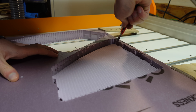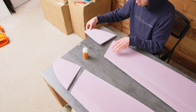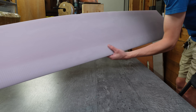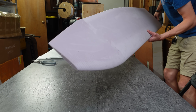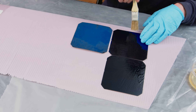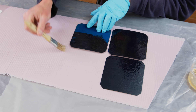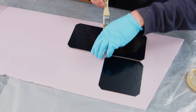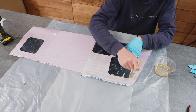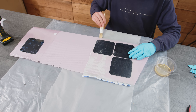That was just the main sections — I also machined some wing tips that got added onto the ends. So that leaves us with two really nice wing halves, but they're super delicate. The trailing edges are paper thin and can get damaged really easily, so I needed to cover the wings in something, and I also needed a way to attach the solar cells. That brings us to some solar cell encapsulation experiments I did, basically to figure out the best way to fiberglass over the solar cells while leaving a nice clear and smooth surface without any air bubbles.